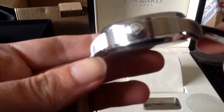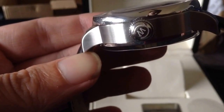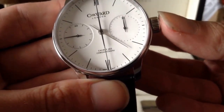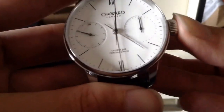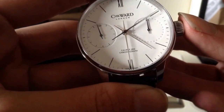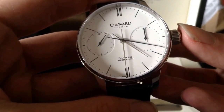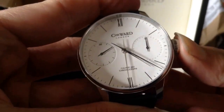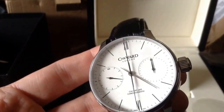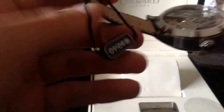Here's the crown — you can see it's polished with a nice matte CW engraving; really nicely done. The button is in the crown, so if I press the button you can see it start going. It does look a bit jumpier than your typical high-beat chronograph because it is based on the 18,000 beat Unitas 6497. If we stop it and then restart — single pushers are just so simple for chronograph functions. I really like the concept of that single pusher or mono pusher chronograph.